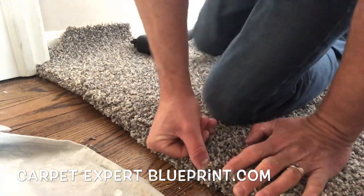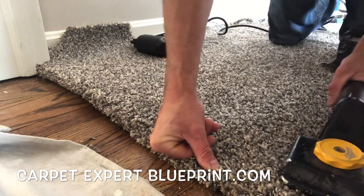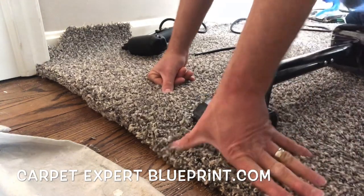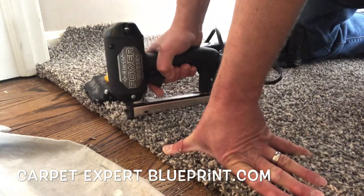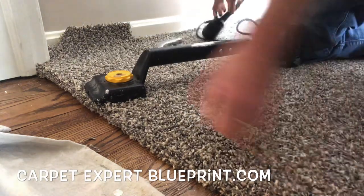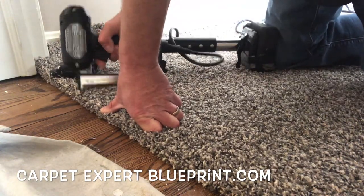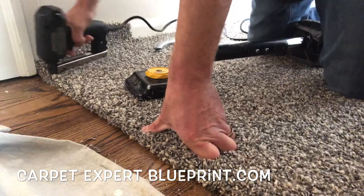Now it's rolled under — let's bring our knee kicker into the scene. Look at that stapler over there — that is the Crane model. Here's the upside to this one: it's got more torque to it. When you pull that trigger, clackety clack, you know where that extra money went. Those go for about $150 to $170 depending on what distributor you buy from. The only upside the Roberts stapler has over this one is Roberts comes with an extremely long cord, whereas the Crane has a short cord so you always have to pack an extension cord. Other than that, this thing is far superior and definitely takes the abuse we dish out in this flooring industry.